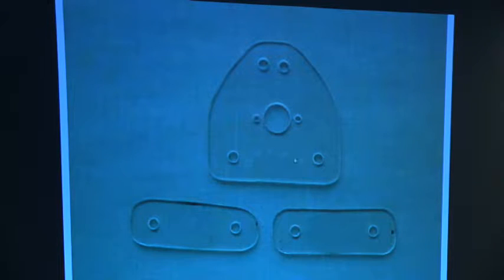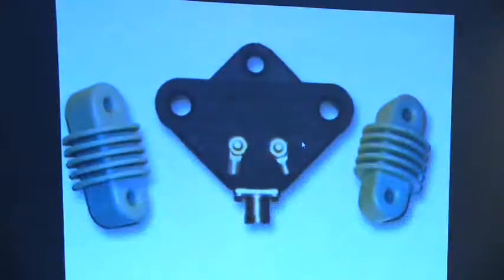You can make the insulators for the center out of any kind of plastic. What you would have is a coax connector here, and this would be where a tie wrap would go, just to hold the string off of your connection to your connector. You would have your loop wires or your dipole wires coming through these holes and connecting there, and there's a way to hold the tension off of that to keep from having problems with it in wind. And that's another view of that.